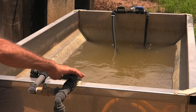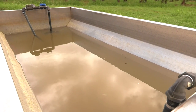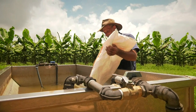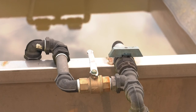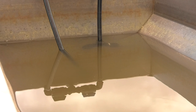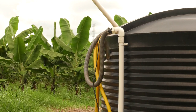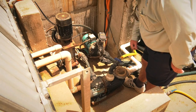The main two types of injection systems used are what we call a V-tank and a bulk tank. The V-tank is a system where we add the fertiliser and it has a water replacement — it is mixed in the V-tank and the water replaces as it is being injected. The bulk tanks, or pre-mixed tanks, are injected proportionally to flow, and this can be controlled by normal irrigation controllers that have this function.